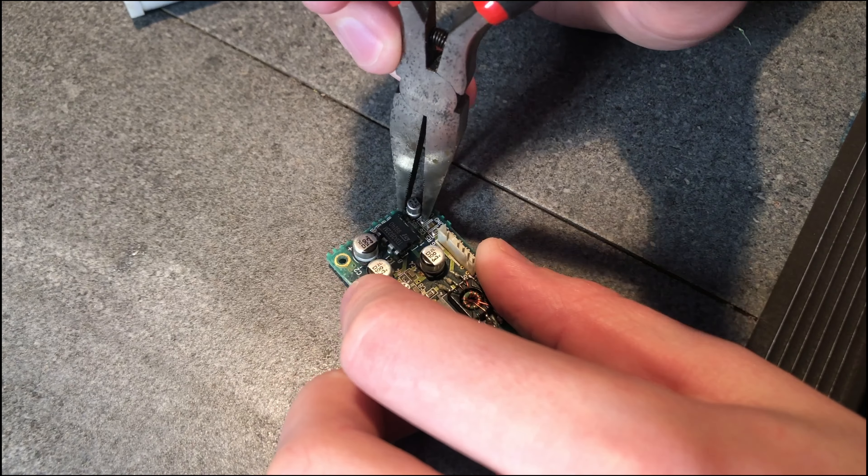I got the capacitor on this side on magnet wire so I can shove them down there, but a different problem happened. When I was doing the magnet wire, this surface mount resistor or capacitor — I can't tell which one it is, the black one, I think it's a capacitor — got bumped and was touching the resistor. I had to desolder and try to push it over, but it looks like it might still be touching. There's a visible gap though, so I'll try turning it on and see, then deal with these capacitors.